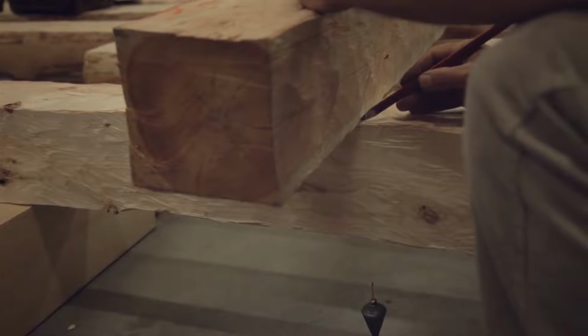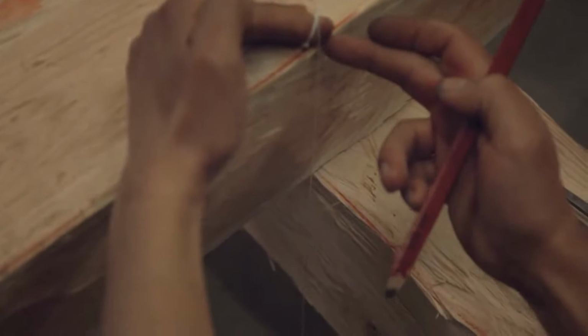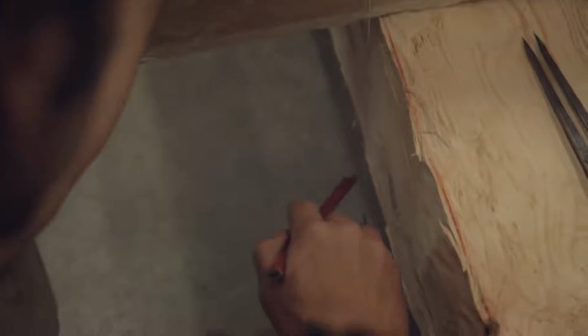We can make a mark on the down edge and on the upper edge. It's in 3 dimensions. I mean, sometimes you can't have your string touching this face. Sometimes it touches, like in this case, it touches here, but not here. So if you look this way, you have the wrong measurement. Your eyes may be like a saw, and you are in the cut you want to do. You measure on the edge here, the plumb touches, the string touches the corner. It means that when I look this way, I have to make a mark on the string.